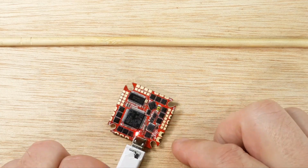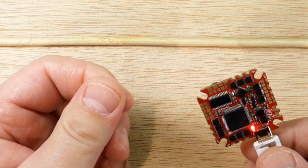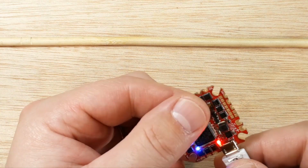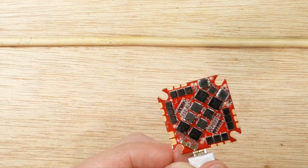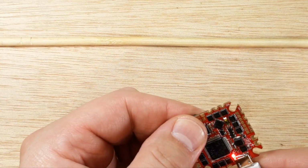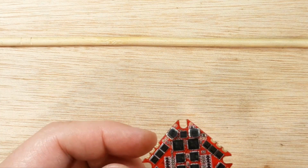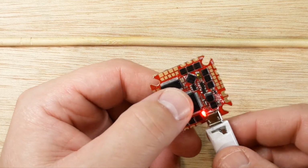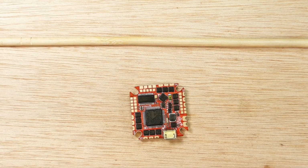All right, so everything's done. I'm just gonna give it a touch, my hands are really dry. Just want to make sure nothing on here is super ridiculously hot. It shouldn't be. These little bucks right here, there's two of them, they can get really hot. And if they're bad, sometimes they'll get really hot, like they'll actually burn your finger. So be careful. No, everything's good. I'm happy. We disconnected from Betaflight so we can unplug our flight controller. And that's a good flight controller in my book.